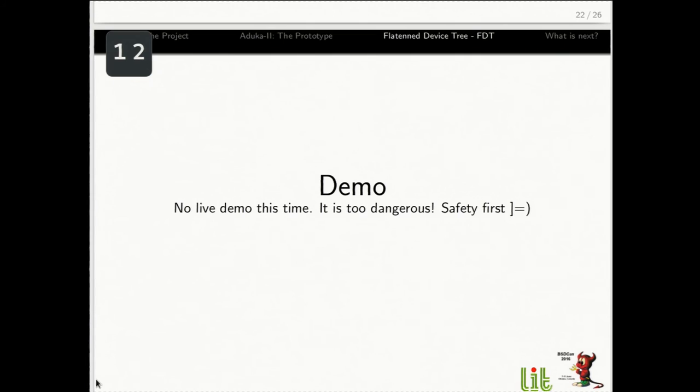Pretty cool. I don't have any questions, just a few remarks and advice. The first one, I'm not sure you will be allowed to do this since you can't refresh the eMMC, but you can modify the BeagleBone Black to add a LiPo connector and use it directly to power the board. If the lab allows you to solder on the board, I can show you, I have a board modified. But I don't think so. Take a picture and prove to them that it worked, and it could be good because you can use the battery directly.